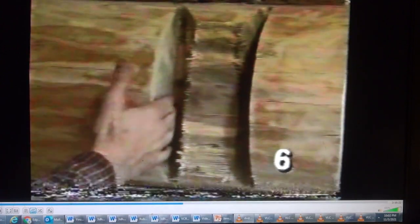Now we're starting to frame up the stud walls here on the second floor to form three bedrooms and a hallway. What we're doing is cutting out notches in the log walls wherever a partition intersects one of those log walls — basically the same way we did downstairs, except up here we aren't notching quite as deep for the stud. But we are making a fairly deep groove for the three-quarter-inch paneling that goes on either side of the partition.